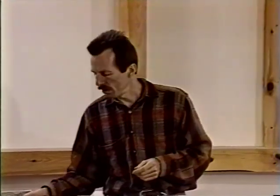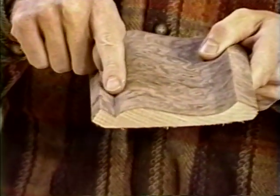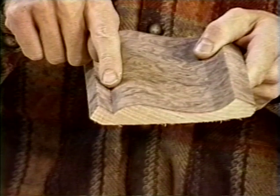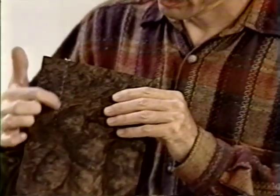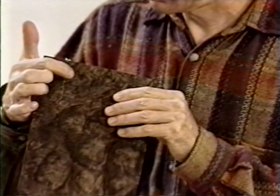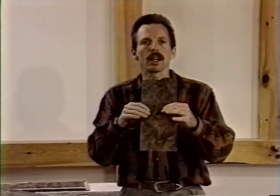Now let's go on to this OG molding. It's a bit more difficult because of this inside angle, which the bag can't get down into. To accomplish this, I do 2 things. First, I sliced the veneer down its length approximately where the inside angle falls on the molding, like that. Then I ran a piece of veneer tape over the cut. What I have now is sort of a hinged piece of veneer.